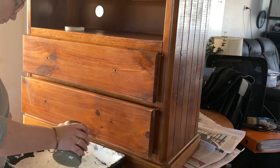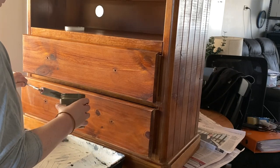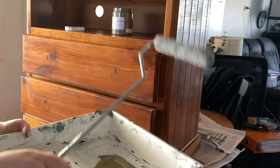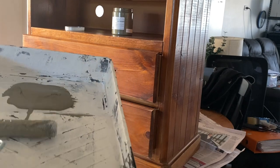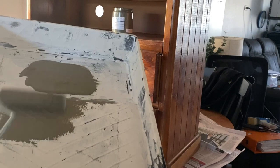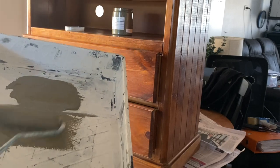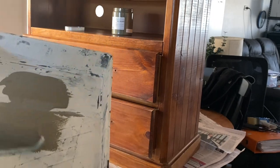So here I am just pouring out some of my paint. Don't pour out too much — just enough. If you need more that's great, but you don't want to waste paint. I've poured maybe a third of a cup here. Then you want to load up your roller just like I'm doing here. Loading it up means getting that paint nice and evenly distributed across your roller, which is going to give you a nicer finish.